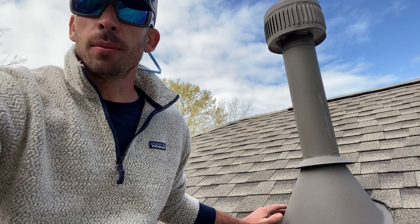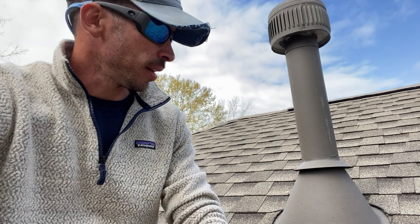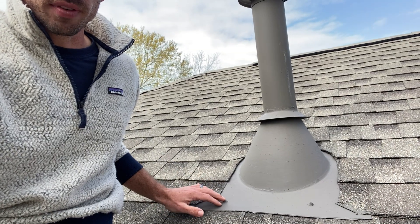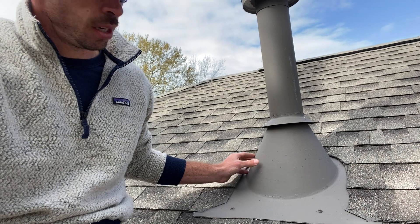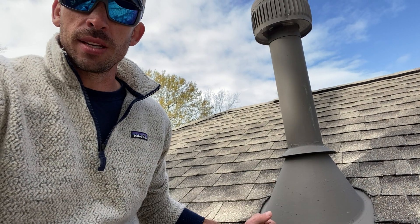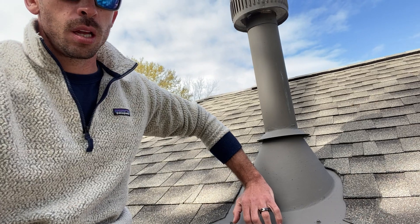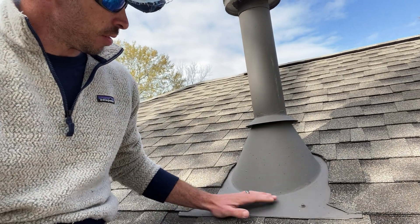This is very skilled labor work, and this is why we're more expensive. We take our time when we're roofing around these. You can see we've got heavy-duty screws right here — two screws to hold this flashing down. This is 26 gauge flashing and these screws are an inch and a half long. They penetrate the deck about three quarters of an inch, so this base flashing is not going to kick up over the years.